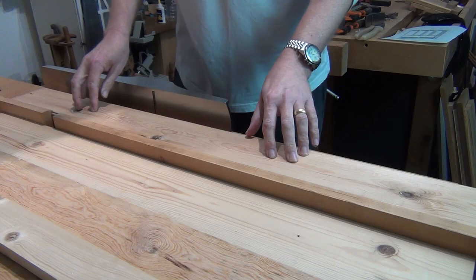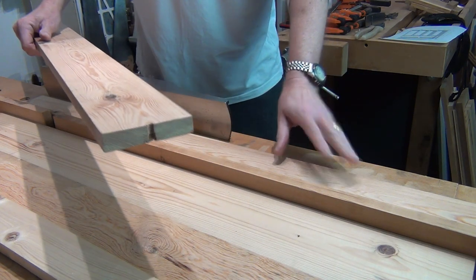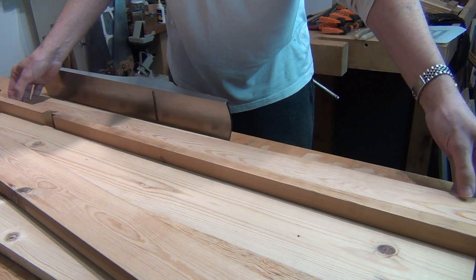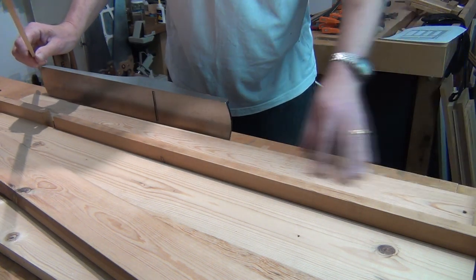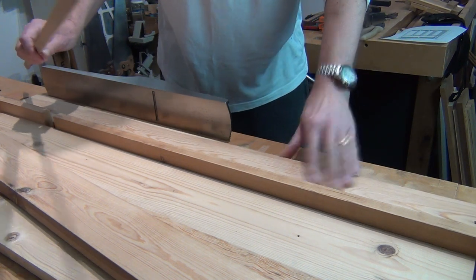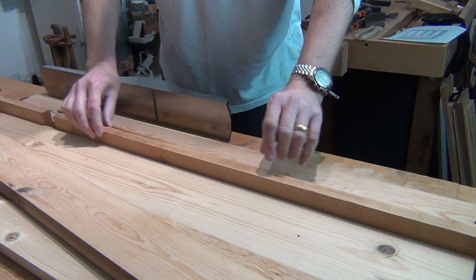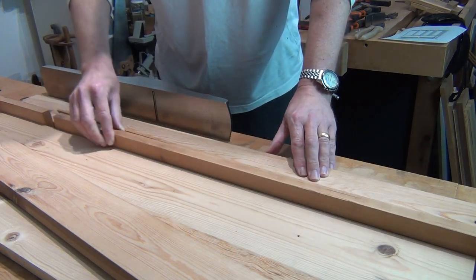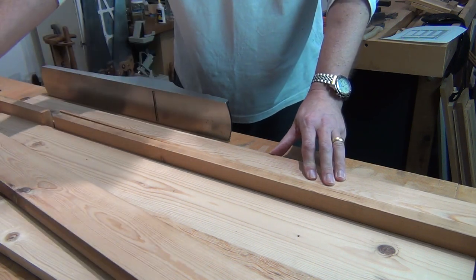What I've arranged here is the board I'm planing, lifted off the bench on top of a second board. They're roughly the same thickness, so I need to make sure the top one overlaps at the front. I've put a little spacer in here, and a fence at the back jammed in between some boards and the bench dogs on the back of the bench.